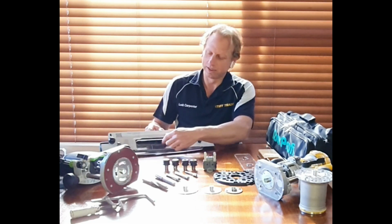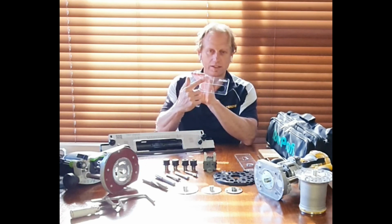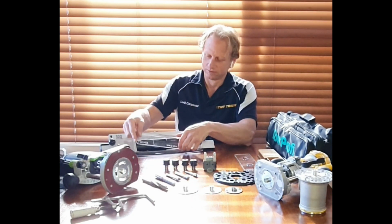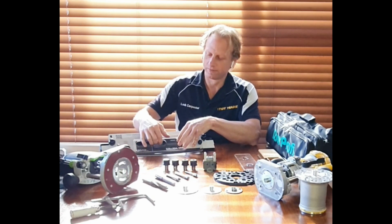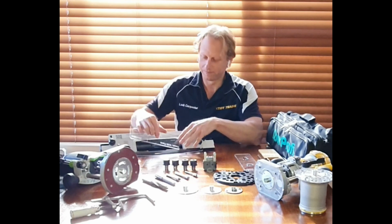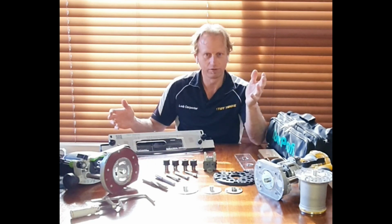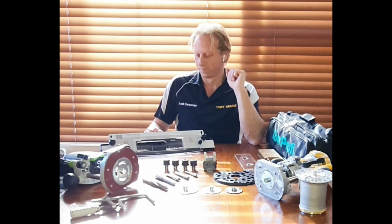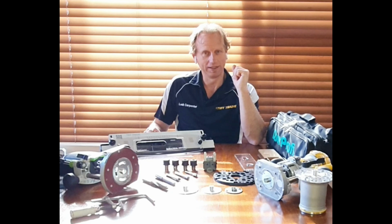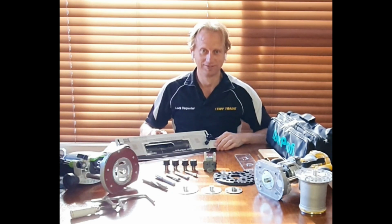Obviously with these, you have 2 cuts. You have a face cut, and then you have a body cut. So it doesn't matter which way around you do it. I could do the face first, put the body one in, and then once I've finished routing, you look down, there's no dust on the floor. It's completely sucked up through this. So that's the TRADIE way. No other jig can do that, not in Australia.